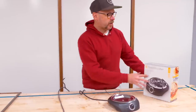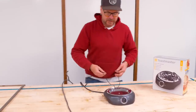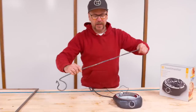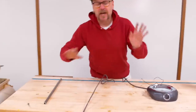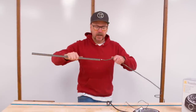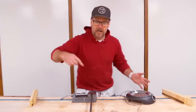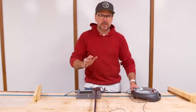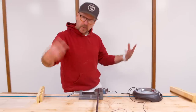For this first method, I'm going to use this really cheap hot plate. I've already taken off the coil, extended the wires, and this coil is bendable. So if I can bend it into a nice straight line, we can heat up the acrylic in a nice straight line to bend it. I've got this half-inch square tube from the home center and I'm just going to shove the heat element inside this tubing. I've got it wired up — I'm not showing you the wiring process because I don't feel comfortable with that. I just extended the wires, straightened out the coil, and plugged it back in.